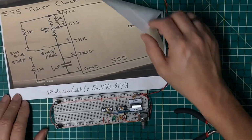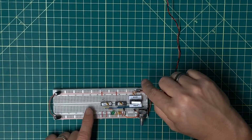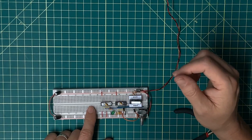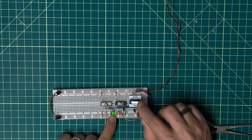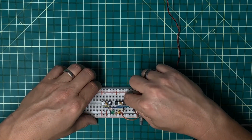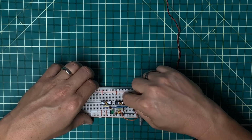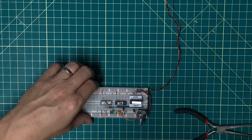Now, I want to try to improve that a little bit, so that it will run up until the point in time that I end up in a low state, and then it'll switch from run mode to not run mode. In order to do that, I think I want to build out this other timer circuit here so that it's constantly running, and I will also use this as part of the reset circuitry. So let me get this one built out.